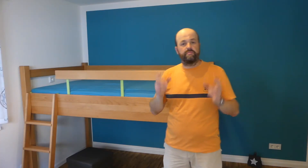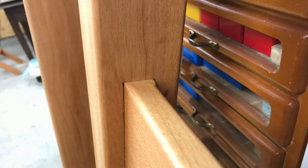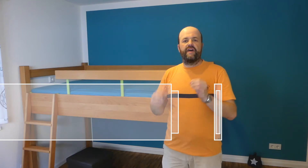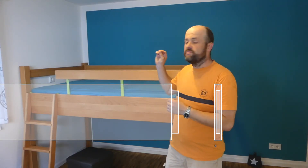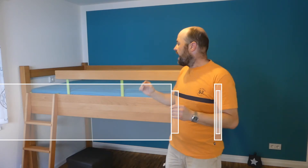One thing I could have done better is something that Alfred Neumann pointed me to — a very loyal and constructive subscriber who always has great comments, so thanks to you Alfred. He pointed out that usually you don't use the whole board as a tenon, which I did. If I had done something a little differently it would have been a cleaner look and much easier, because if I had made the tenon a little bit smaller and shorter than the board, I wouldn't have needed to cut the mortises so cleanly.